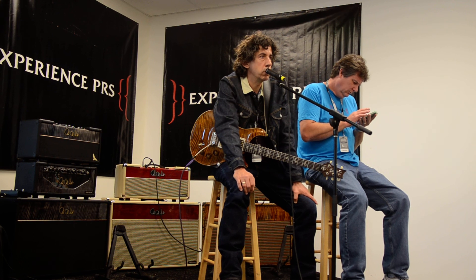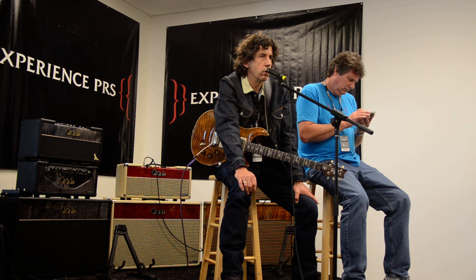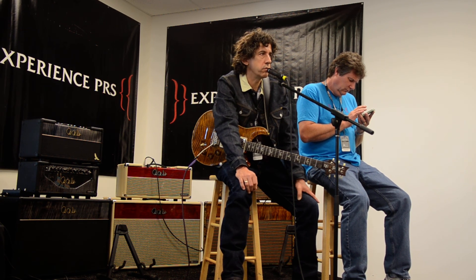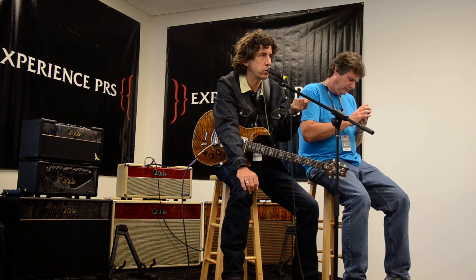It was really important for me to make sure that the amps were equally road-tested and studio-tested. When you spend $3,000 on an amplifier, you ought to get an amp that's good for any gig and equally usable in the studio. That's an issue I've had in the past with certain vintage amps that sound kind of godlike if you're 6 to 10 feet in front of them. Then you take them into the studio, you have to keep moving the microphone around, and you never quite get that experience of standing in front of the amp. A lot of old high-powered amps have tons of low-end and can be scooped in the mids — when you put a microphone in front of it, it picks up those accentuated frequencies and doesn't always record very well.